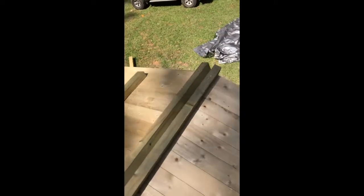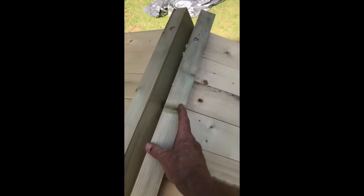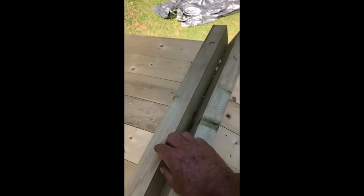The way we do roof battens on this type of construction is we put these two right up here on the very peak, because our center beam on our ridge comes right through underneath and we want to bolt these 125mm batten screws into the top of that center ridge beam. When you screw down into there, make sure you hit into the top of the center ridge beam — in this case the ridge beam is nice and wide at 70mm, so there's plenty of meat for the screw to hang into. Put them about every one meter apart.